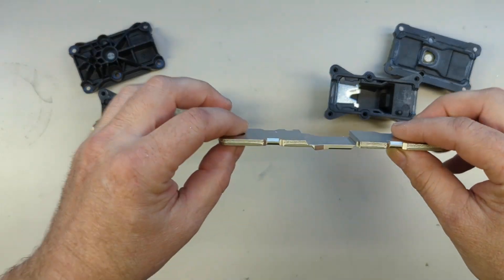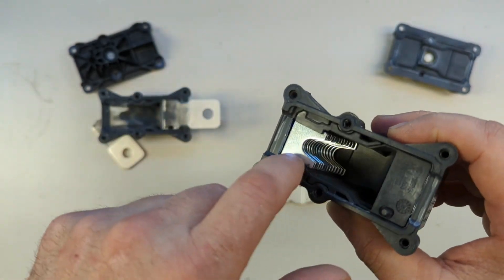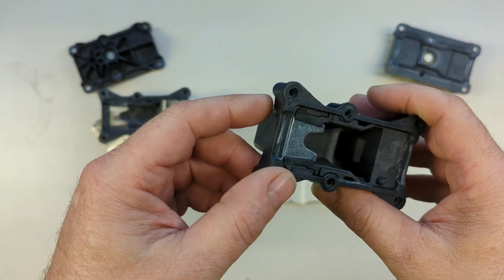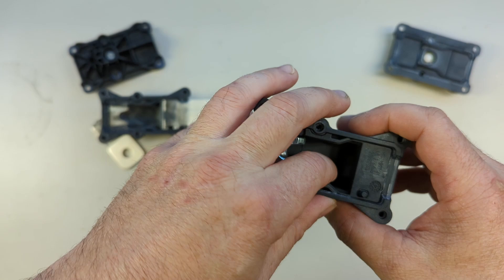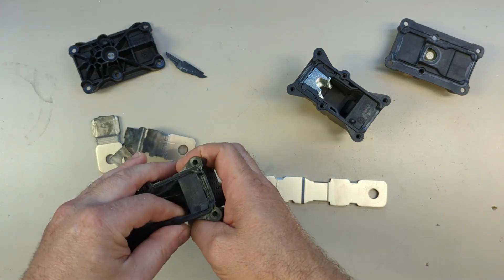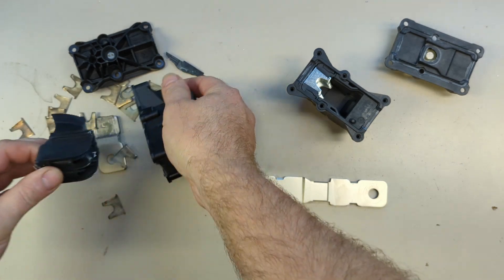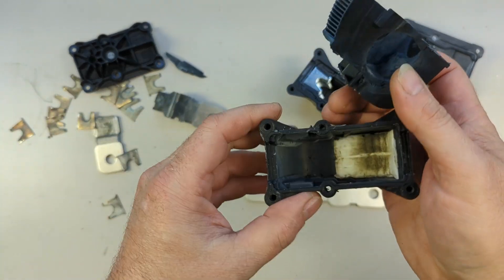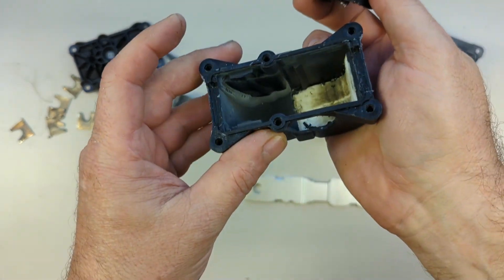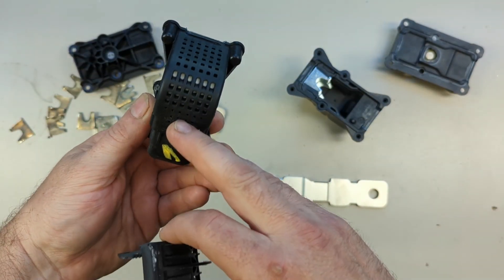And if it's blown under load, the pressure of that gas blows the arc into this splitter — it's a bunch of metal plates that cools off the arc and extinguishes it. Then the hot gas continues. The splitter fell apart. The hot gas is forced through the splitters, which would be here, and then under this — you can see where it's gray there — and then into this filter, and then it vents out the side of the housing.